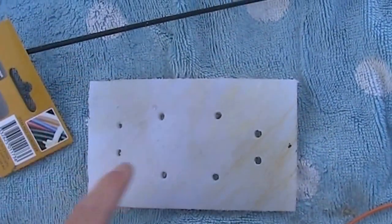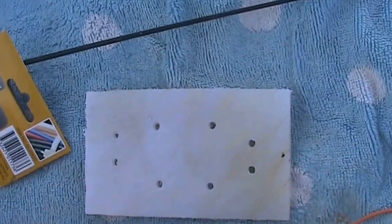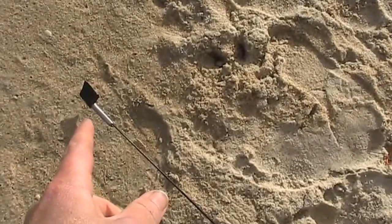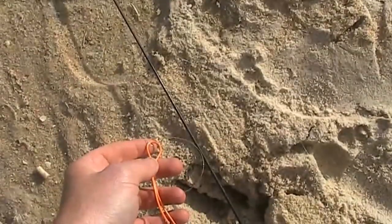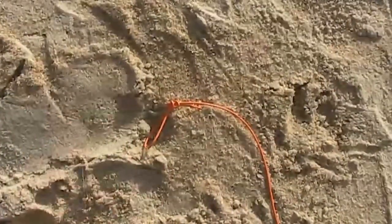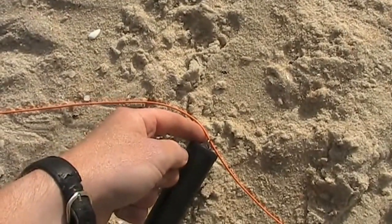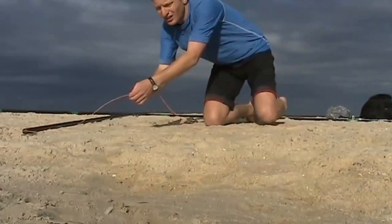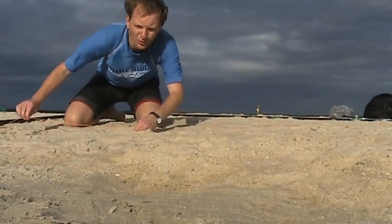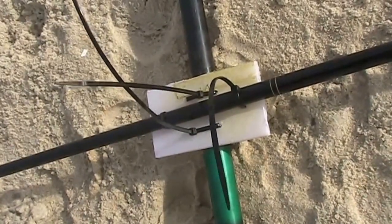Made out of chopping board is a cross piece. The thick vertical pole goes through there and the thinner horizontal pole through there. I'm using cable ties to tie them together. I'm using some tape just to anchor the fishing line to the top of the grid pole. The elements are asymmetrical — the reflector has a bit less of the fishing line than the driven element. Conveniently, the bottom of the smaller pole has a small ring that I can pass the wire through.